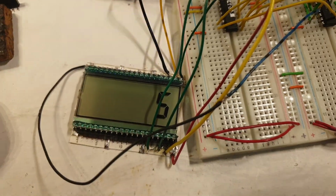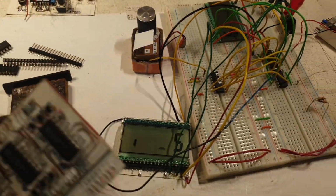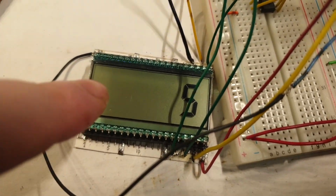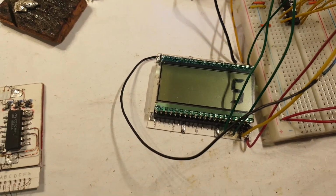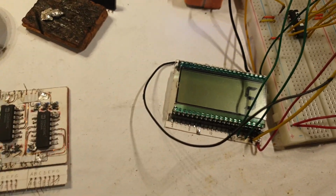I made another board with the display, and there is the driver here. I discovered something when I first built it. It doesn't have any errors. When I'm putting my hand on the table, Pro is getting some errors. But if I'm lifting my hand from the table, it's fine. Probably the 50 hertz from my hand is getting in somewhere there.